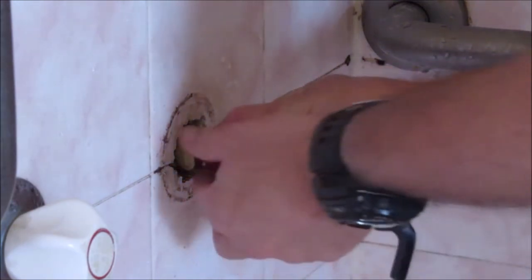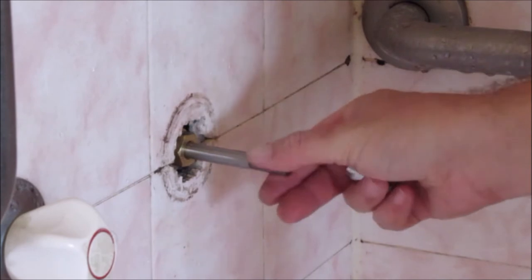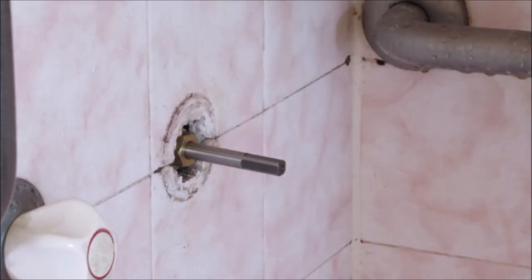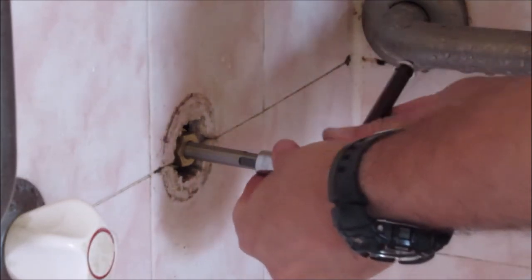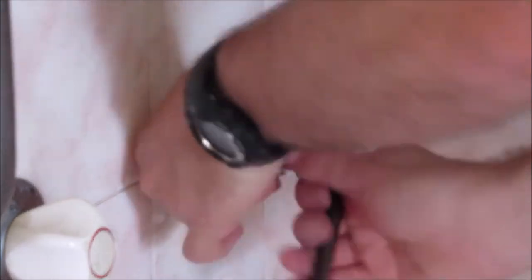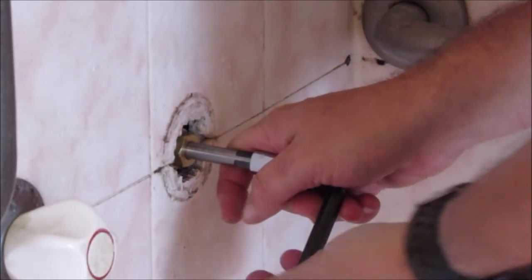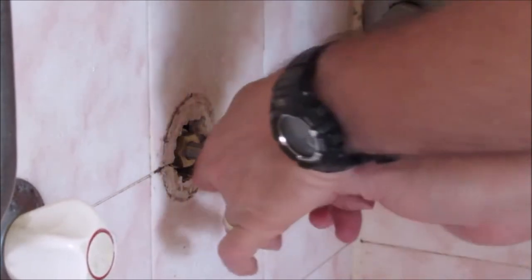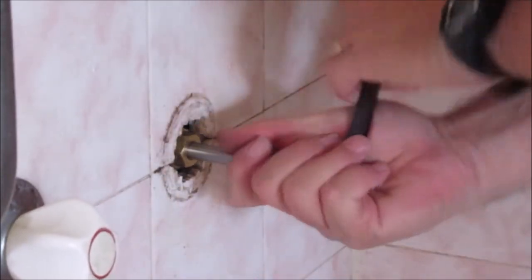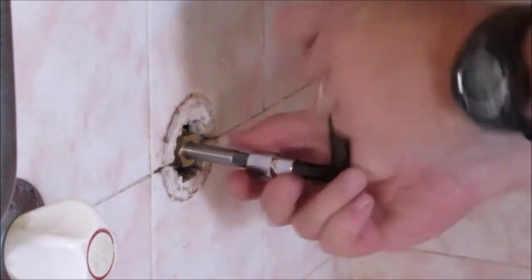Let's screw this in and see how it goes. This will screw in as though the handle was going back in, and then this will screw in and create a new thread based on that. Now the instructions just say to screw it in and create a new thread, but when I did my apprenticeship years ago and we did some cutting of threads, we'd go a bit and then just go back to cut and remove the burr. I'm not sure if we need to or not but that's what I'm doing anyway.